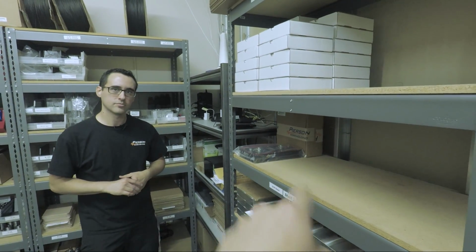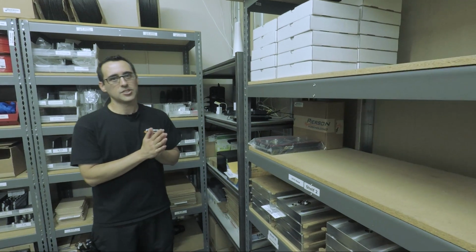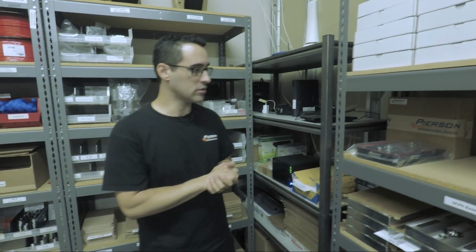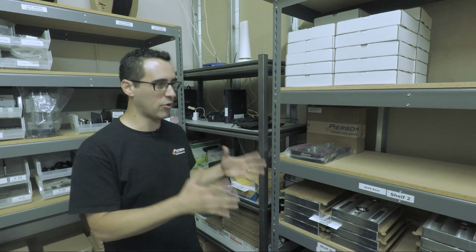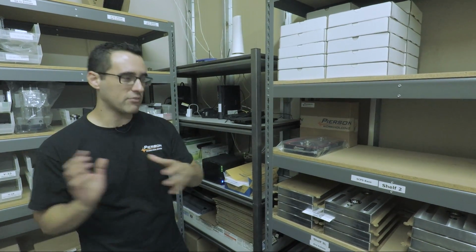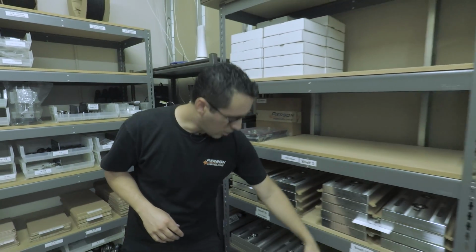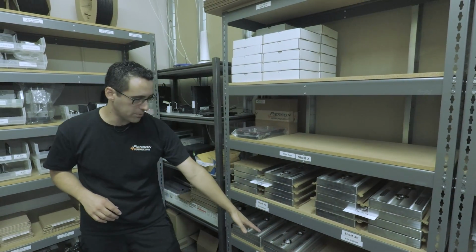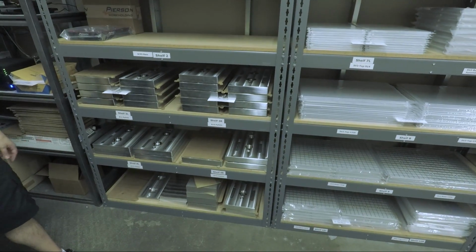That bothers me. That's too lean to me. Well, it's based on historical sales, and that doesn't lie. If we're selling like 4 a week, well, we just need to know that we have to have 4. Got it, on a weekly basis. Do we have everything to do that? And like we showed last time, our 10-16 pallets are the most popular. There would have been a Kanban card here at 6 or 4, and that triggers production, which is out there.